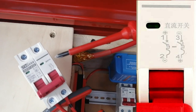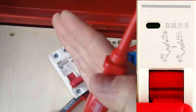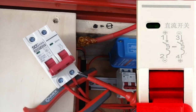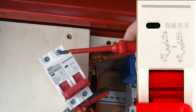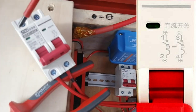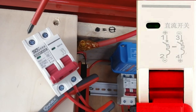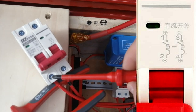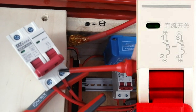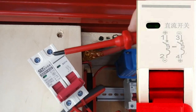So you have to read the diagram differently. It means plus is here and minus is here - you split up the two sides of the breaker, left and right. The higher potential is on one side and the lower potential is on the other. On the right side it is the opposite: the higher potential is here and the lower potential is here. So if you wire it up with black as minus/negative, the source - for example the battery, or in my case the solar panel - the positive wire of the solar panel goes in at the higher potential side, and on the other side is the lower potential. Then it goes back to the battery, with negative going in at the higher potential side.